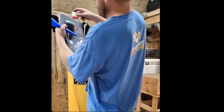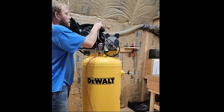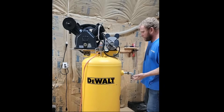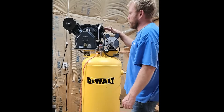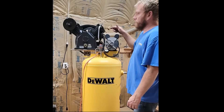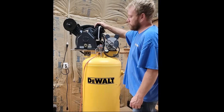It is made in the U.S. I'm going to fill it to the upper edge of the red circle. Got the air cleaner on, the line looks good, oil's in the motor, switch is shut off, both valves shut off. I'll put a guard back here. I have no doubt the motor will run the compressor at first — my concern is when it gets up to 175 pounds, is this 3.7 horse motor going to be enough to pull this two-stage Harbor Freight pump that says it needs 5 horse?